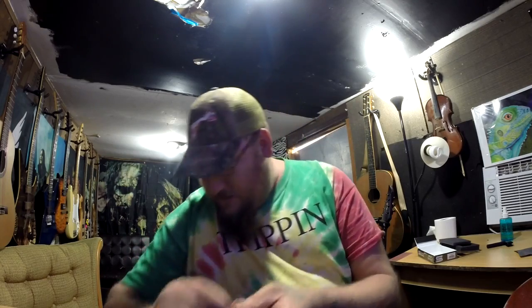So red and white, these will be tied together. And I'll tell you guys what they're used for when they're not tied together. So red and white will be attached together, which I'm going to solder in the shrink wrap or tape. And then green and bare will be together. And then basically the green ends up being part of your ground wire, and then the black is actually your hot, and then these are off on their own tied together.